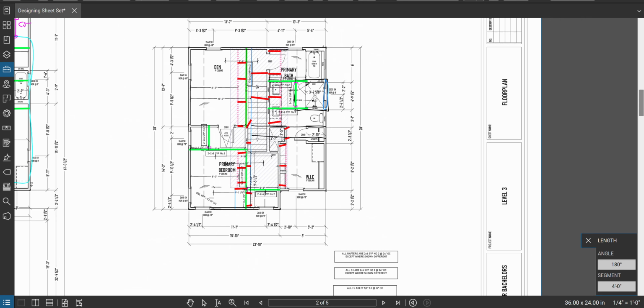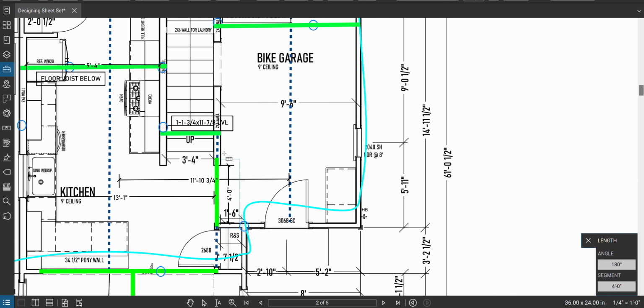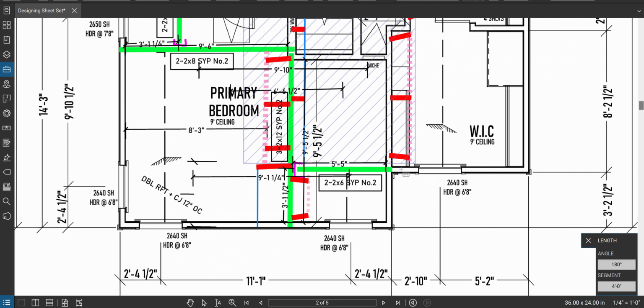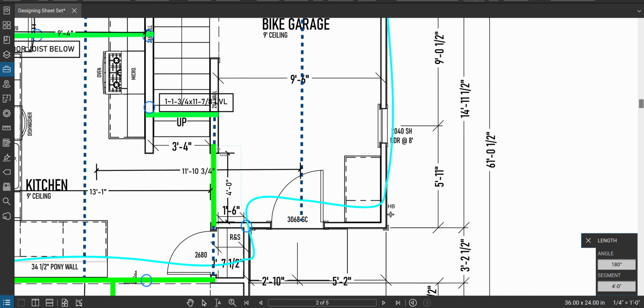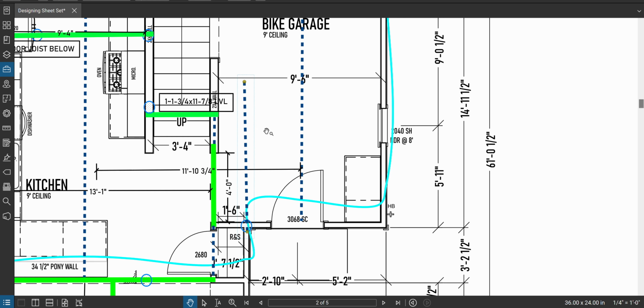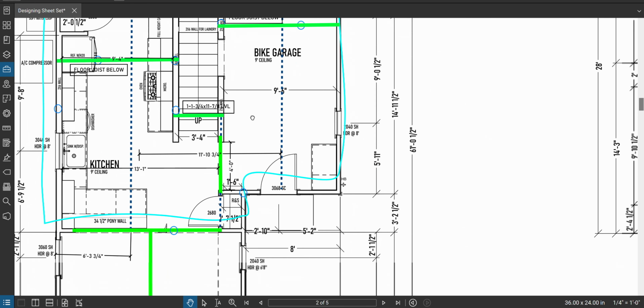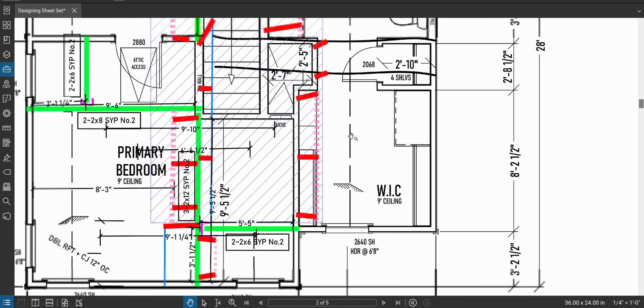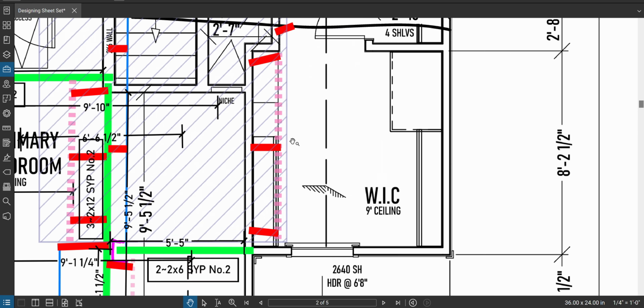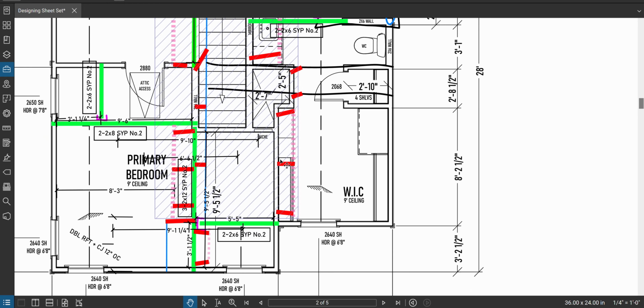So it's extra heavy. So what I need to do is make sure that weight comes down onto something that can support it. Well, in this case, this wall is in line with this corner, which is not landing on this wall. It's actually right here, if I could draw a line properly. It's like right there. So the only thing above that is the floor joist. So I need to actually make sure that my floor joist either can hold that or that I put another beam in or something. And in all likelihood, it's fine that my floor joist can hold it, but I need to check. All right, so I need to account for that as well.